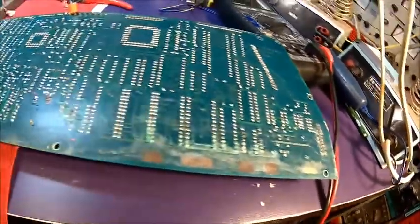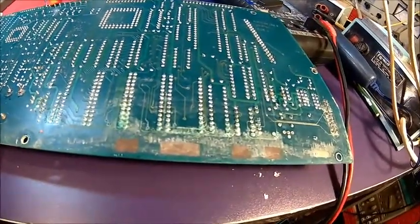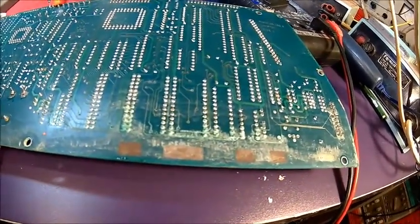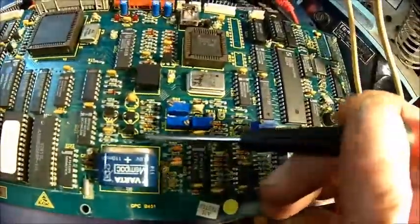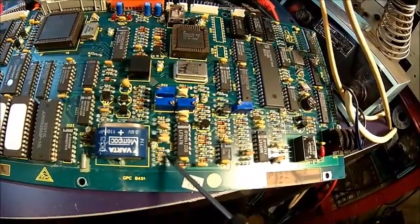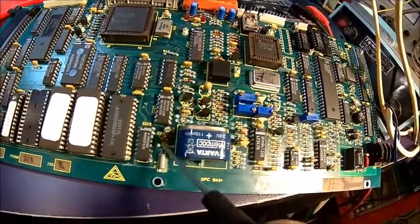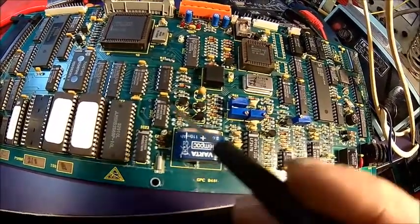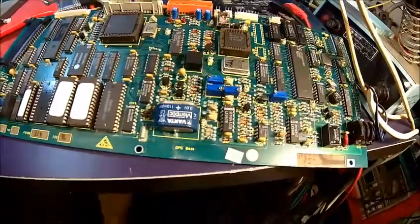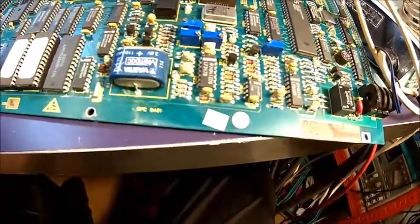The keyboard is here and that's the display unit, and if this is all dirty let's clean that and give it another try, and check the other boards as well. We've got the rear side clean but there is an awful lot more — I think it was all the battery. There's a lot of corrosion around here in that area, so we're gonna remove that battery and clean it as good as we can.